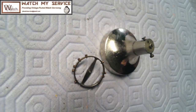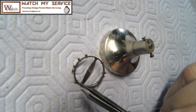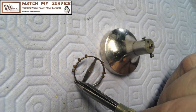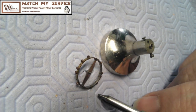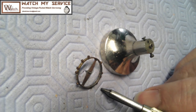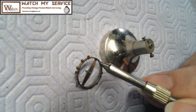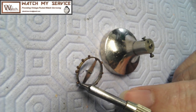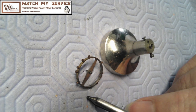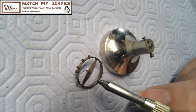To remove weight you can do two things: I can remove weight from this screw here, or I can add weight to this screw here. Adding weight to this screw could slow down the rotation of the balance. If your watch's regulator is towards the fast position, that means the balance is running slow and you're trying to make it run faster by shortening the hairspring. If the regulator is dead center and you add weight to a screw, it's going to slow the watch down a bit and you'll have to move the regulator over to the fast position.